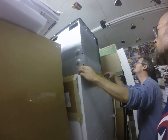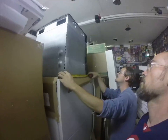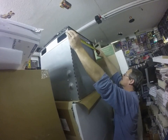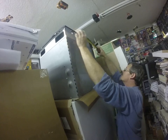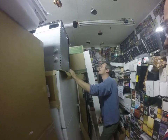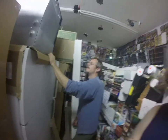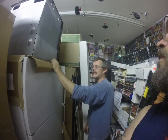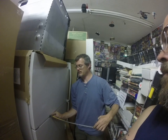That'll give you — if you put the edge of your counter there, technically you're going to be coming out to right here. So if we have to adjust that width and come out to twenty-one, that's cool. That'll be an inch overhang. The base has already been established, so you'll have a one-inch overhang, which is good for track lighting.